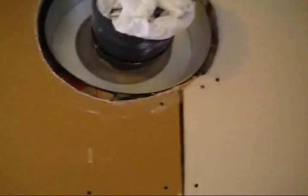We're wrapping things up - doing the drywall. We removed the ceiling fixture there and moved it with a little frog-eye light that will shed a nice light on top of the wood burner. We're going to put the wall thimble in place. Everything in here is meant to be an open area where there are no combustibles anywhere near. The insulation is already in place. We put cement board behind where the stove is going to be - wherever there would be any heat exposure. Now we're ready to tile. We've got our wall thimble - it's all to code and all good.